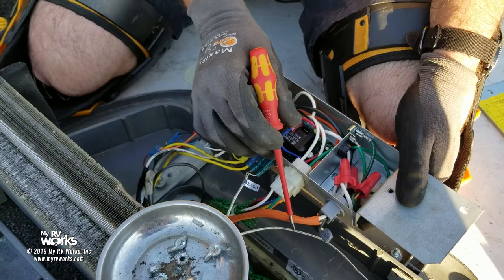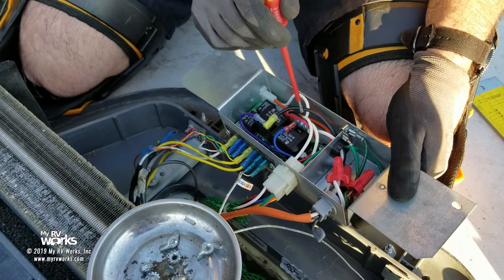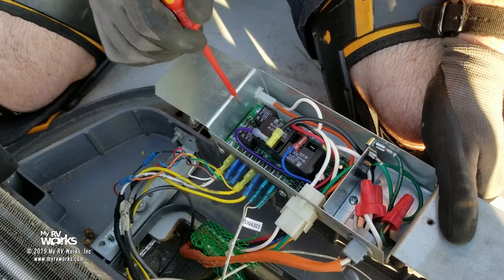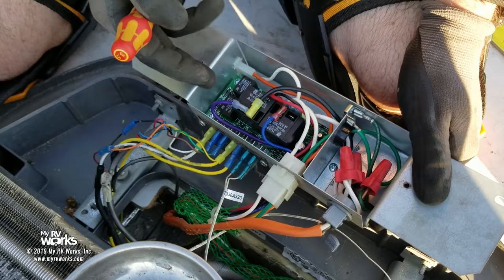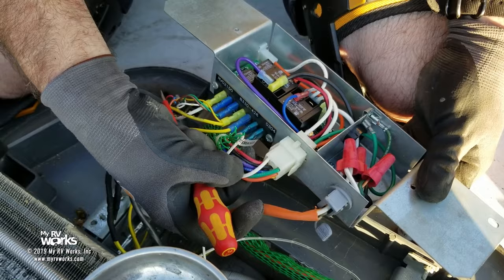Let's follow the black wire right here, right? Because we know this is going to be connected to a circuit breaker down below. Here's my black wire right here coming in to the wire nut. I'm going to land on this relay. What's on this other relay? The purple wire, isn't it? Okay, so we're going to come in to my circuit to the black wire, and the purple wire is the wire that I'm after for my compressor. And it goes through my connector and it comes out the other side as a, you guessed it, purple wire in there somewhere. There's my purple wire, okay? So what we need to do is verify we have 120 volts on the black wire.